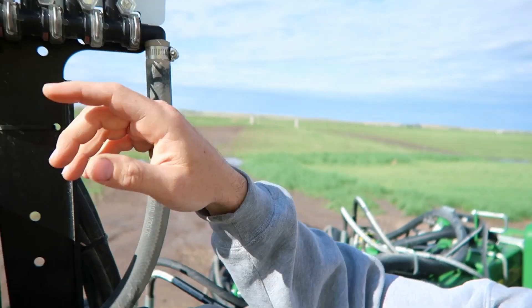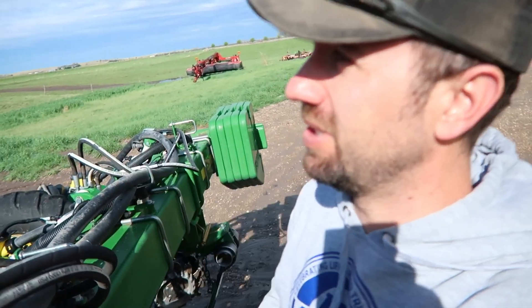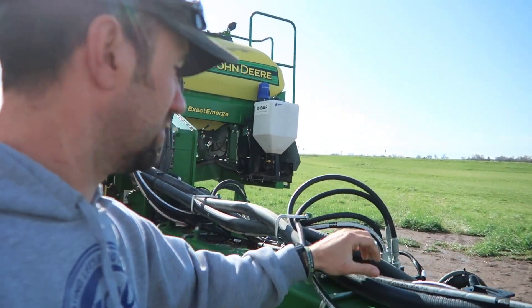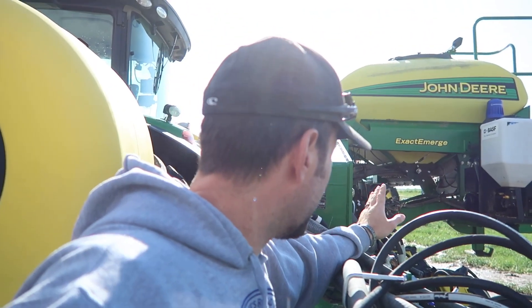My red balls — you can see it almost probably looks black on your screen but it looks like blood going through the system and you can't really even see your red ball. So I want to get that flushed out for sure, and then if I feel ambitious I'll take out these tanks. Another problem I had too is last night I was planting beans and my row number one is getting blocked in the tube somehow. So I'm gonna have to drain out that tank — it's about half full — to see what's blocking row number one. My brother had something happen in the past where a tag flew out and he didn't know it and found it later. He had to do the same thing on his old 24 row.